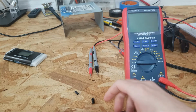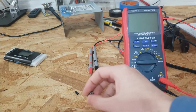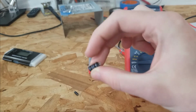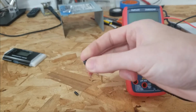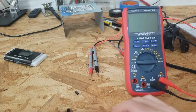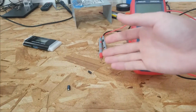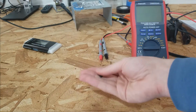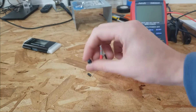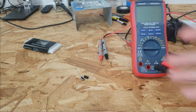The stuff I look at is perhaps 20 or 30 years old, and that's just when the USA started importing these really crappy Taiwanese, Chinese capacitors, in the capacitor plague era. And so you'll find, not always, but typically, if stuff hasn't been powered on in a long time, these capacitors are really prone to failing, especially in power supplies.